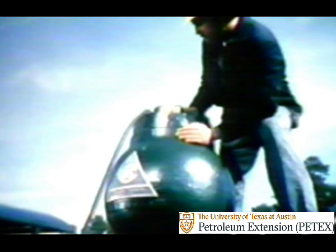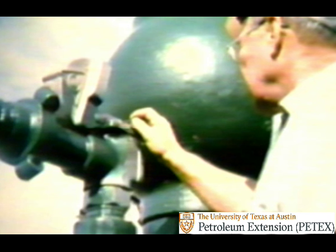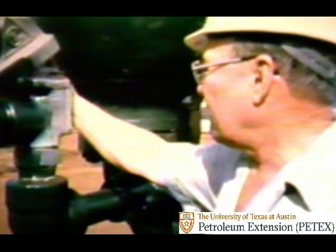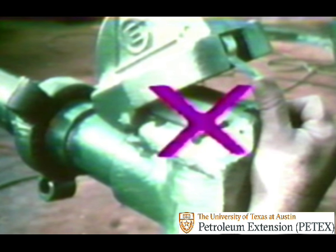Before you start up the pump, prime the dampener with nitrogen and check its nitrogen pressure gauge regularly. The pressure should be kept to manufacturer's recommendations so the dampener will do its job correctly. While you're there, make sure the pressure relief valve on the discharge line is set correctly. If the hydraulic system becomes blocked, the relief valve will open, allowing excess pressure and mud to flow into the relief bypass line. Relief valve setting is normally a little higher than the liner working pressure. Adjust the valve by inserting the correct size pin for the pressure you want—and never use a nail or welding rod, as it might not shear at the right pressure and then people or the pump could get hurt.